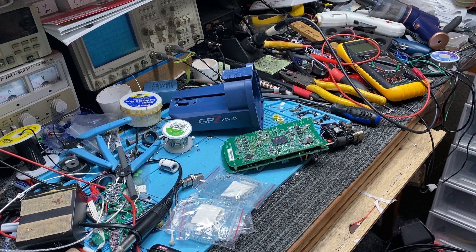I've just done the receive module. Remember I was saying that because it was hermetically sealed you can't do anything to it — well, that's not entirely correct. You can do things to that module but you use the external control pins. We can do a few more things to the 7000s and basically get them quieter without losing anything in the sensitivity.